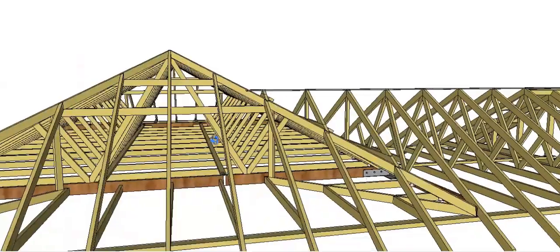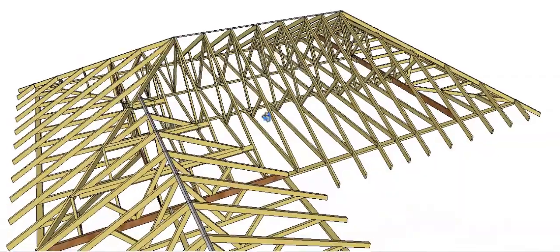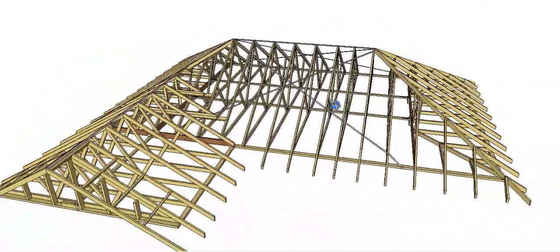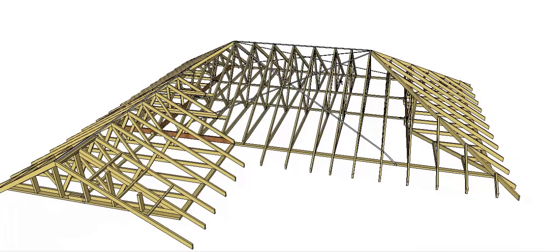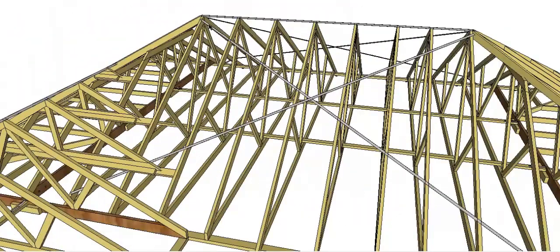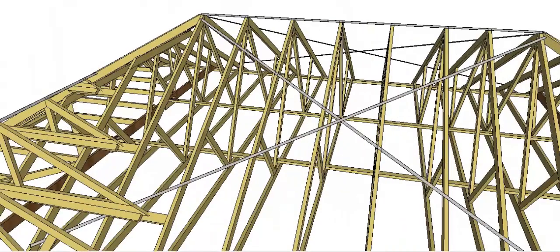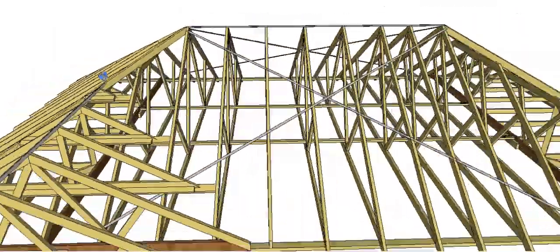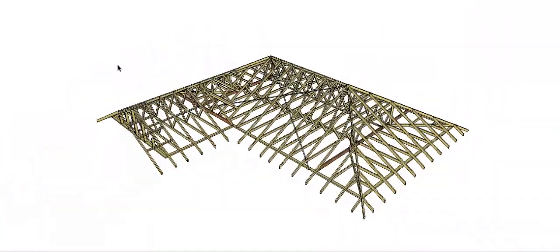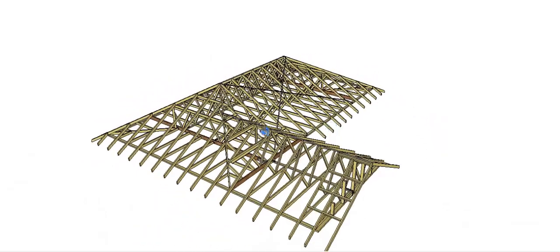There's all your longitudinal ties — or ratrunners as I call them. You'll need to put in your bracing as well. I've just thrown in a little bit of bracing here — cross bracing tied down so it wraps around underneath your top plate, and it generally goes over the truss and down the side of the truss a little bit on my apexes as well, just helps to tie things together. Depending on what your truss manufacturer has specified, you may need to have bracing across the ends as well — just depends on your area and your tie-down requirements.